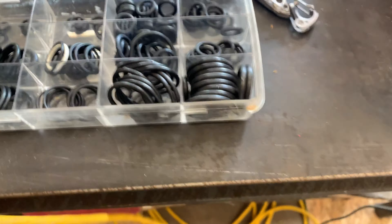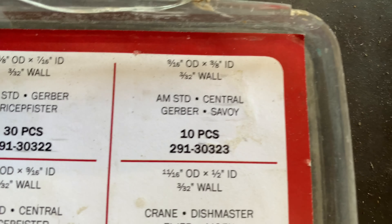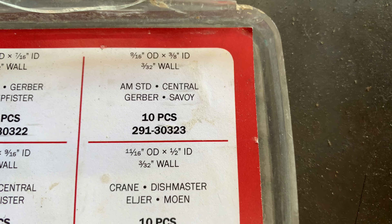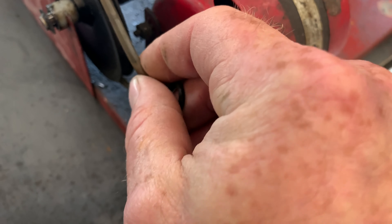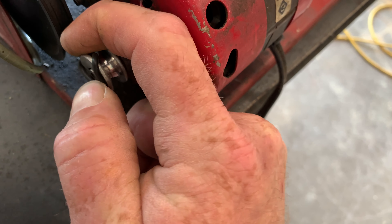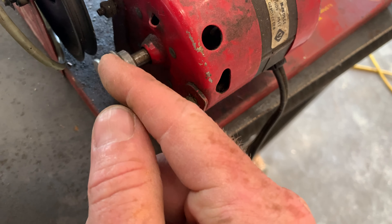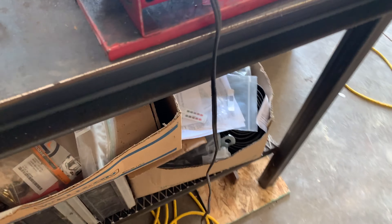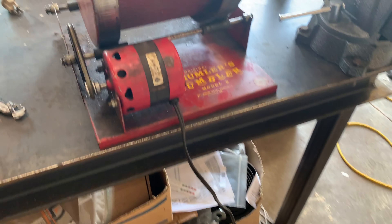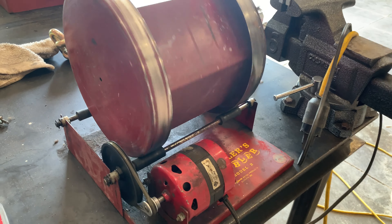What I've got here is a generic o-ring kit. The one I'm using right now is the 9/16ths OD by 3/8ths ID, 3/32nd wall. What I'm going to do is pull the belt off the motor and slide this on. You can buy the individual o-rings. What it did is it filled in that lower valley. Now I line up my belt, flip that on. What that did is it just made it 3/32nds longer. Boom. Now you can see how much faster it's going — it's not skipping or slipping out.